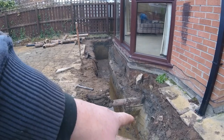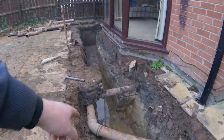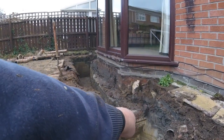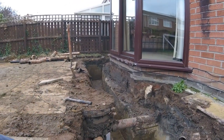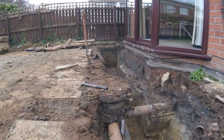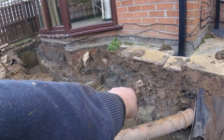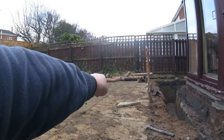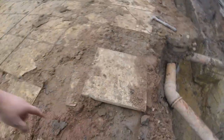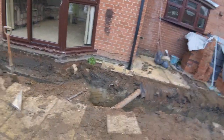We're going to move the manholes outside the extension - we don't want them inside for smells and things. This one here goes to the kitchen gully so that's going to be done away with. That pipe there goes under the building - that's the main sewer, only doing a gully - so we'll move that manhole outside and put a gully on the outside of the building. That pipe there is the storm manhole, and we're going to extend that one outside too. Then we'll put the downcomers one either side of the building.